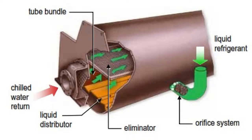Its main focus and goal is to help spread the refrigerant out, because you have to think, you may have a 20-foot long evaporator, bigger, longer, and you need to make sure that refrigerant gets distributed evenly across that whole evaporator. This is where the eliminator in the top, which looks like a screen mesh off of a door, comes into play. That eliminator is literally just a big screen.